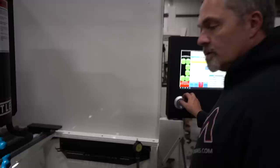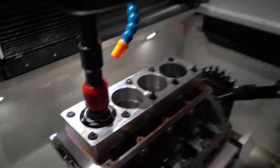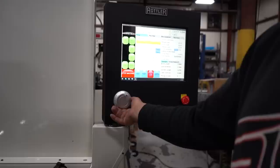Now we're going to turn the stones out to just start making contact. Is that correct? Yeah. When it makes contact, it'll just stop because it won't let me overload it, right? That's right. So we can just run it right out to it? Yes, you can run it out and then back it off. Ah, see there? Okay, now crash. Hit okay, and just cycle your power. Now just back your stones up a little bit. There you go.